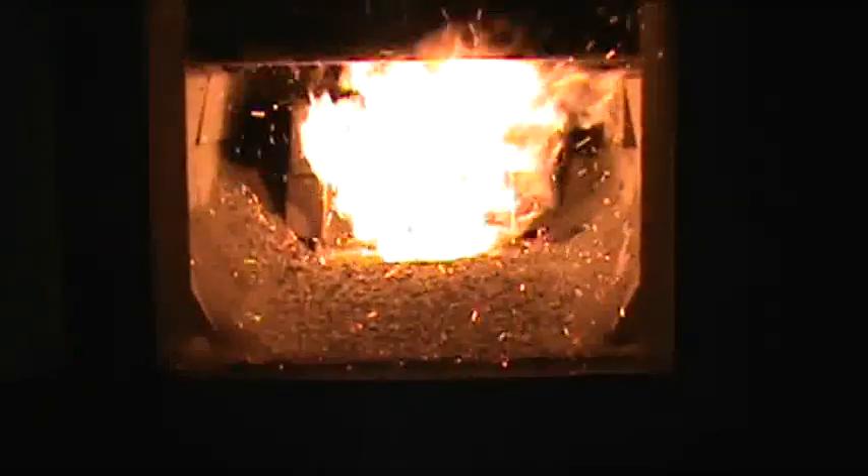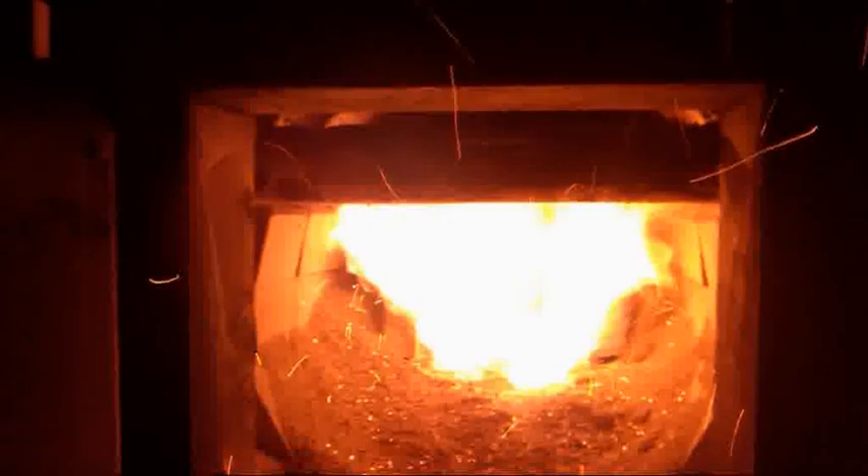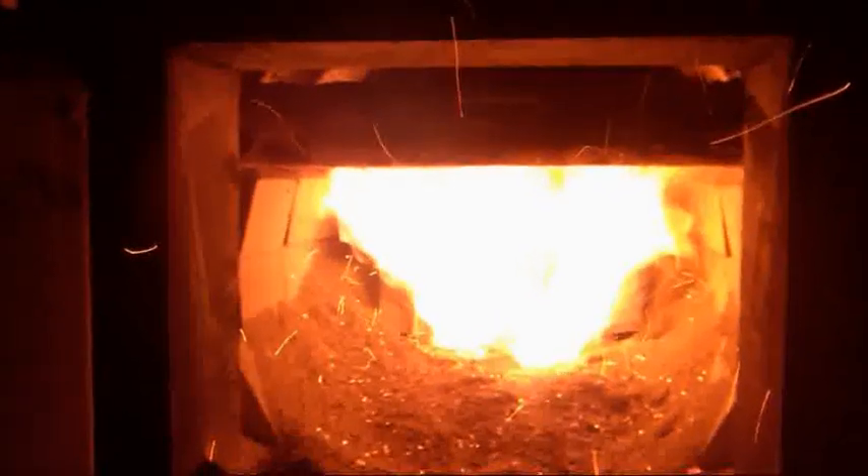Chips are fed straight into the burner through a three inch auger with heavy duty three-eighths flighting. This unique heavy drive enables us to feed chips, sawdust, and even dry pine shavings in such a way that burn back will not happen. The boiler is constructed of quarter inch cold roll steel which is double welded and round in shape, versus a box design which may not be as strong.